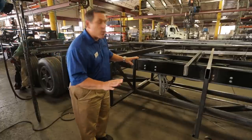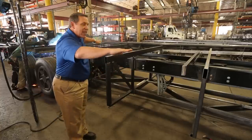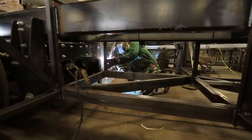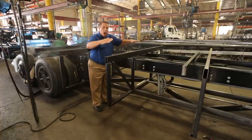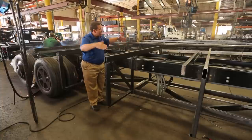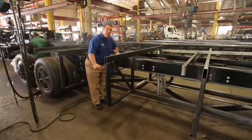When we were out in our chassis yard, what we saw was the plain Freightliner chassis with a rail — it's right here, we've not removed that. What we've done is leveled the front and back of the coach to make that rail straight through and square. We've added vertical supports that run up and down, giving you the perimeter of the chassis. On the perimeter of your motorhome is where you have your kitchen countertops, your refrigerator, your sofa — that's where all the weight is. What we want to do is take that weight and transfer it back to the center of the coach, so we've added supports that run from the outside back down to the center rail.